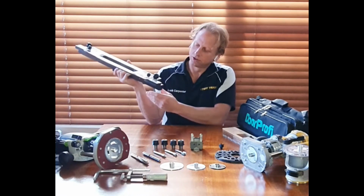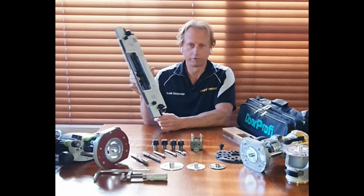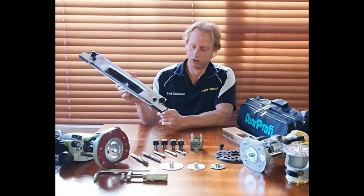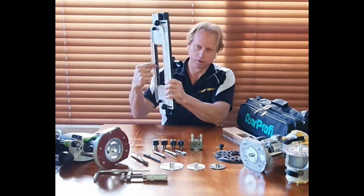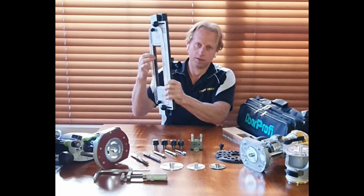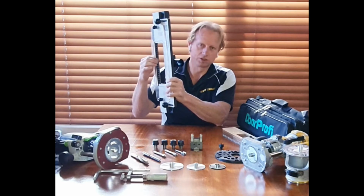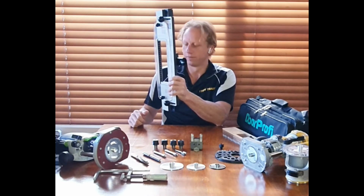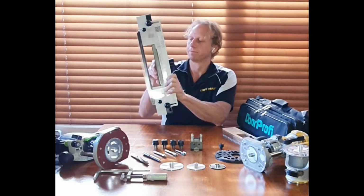This rail slides across, depending on where you want to put it on the door frame. There's so many ways you can use this thing. On the face of the door. In here, you've got markings, zeros for the middle, and then you've got reference points wherever you want your center line to be. If you're doing hinges, they can be anywhere on this because there's so many different sizes. We can't have just markings for one hinge or one lock or too many reference points. So this gauge will help you.